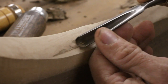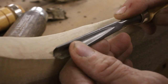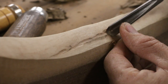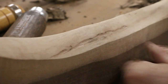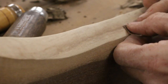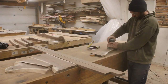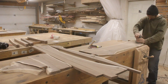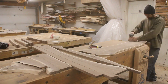A couple of times I found indents I couldn't sand or chisel away, so I had to get a carving chisel to remove those and then come back with a little bit of sandpaper to flush them out. Actually carving this piece got me to realize I really should be using a wire wheel instead, because that would address the same defect all over the natural edge and leave the piece with so much more character. After that I went through all my pieces and sanded everything up to 120 grit to remove all the mill marks and any imperfections.